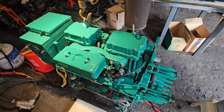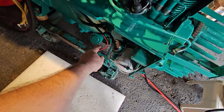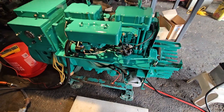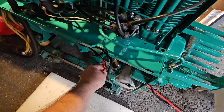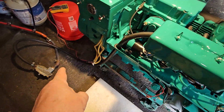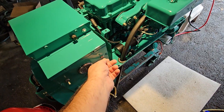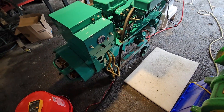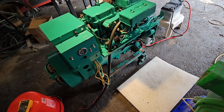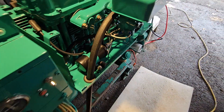Okay, so there she is — that's what it sounds like, everything seems to be running good. I'm gonna make a couple modifications. You can see some wires hanging out over here. These sets were designed in the factory to run on a mechanical fuel pump — we're going to change that over to electric. This will eventually be hooked up to an electric fuel pump for gasoline. For the electric solenoid that'll go in line, I have a separate line, and we'll add a toggle that will energize one or the other depending on what fuel you want — no sense powering an electric fuel pump if you're running natural gas.